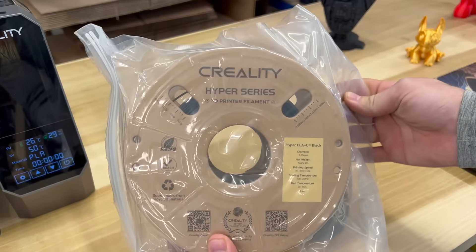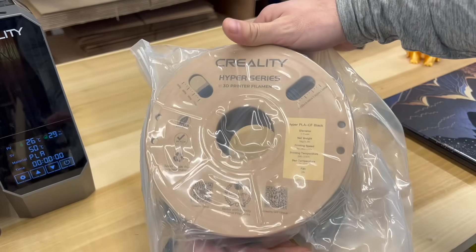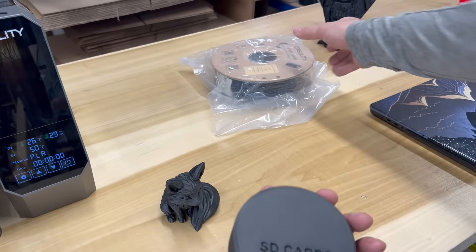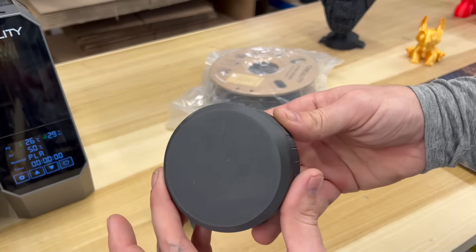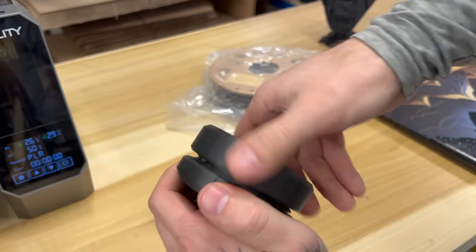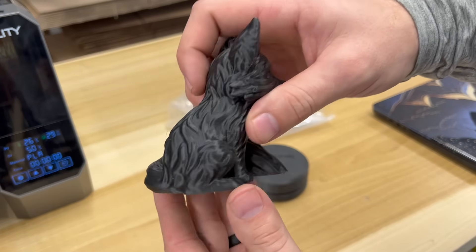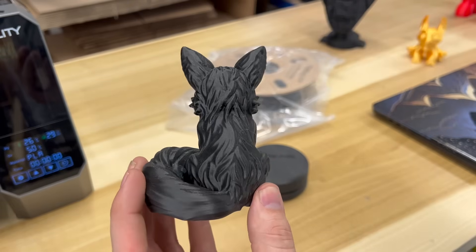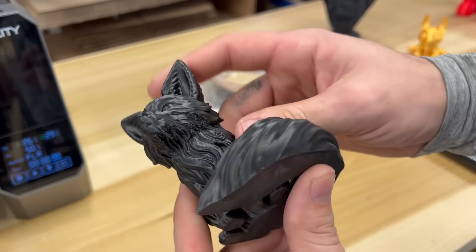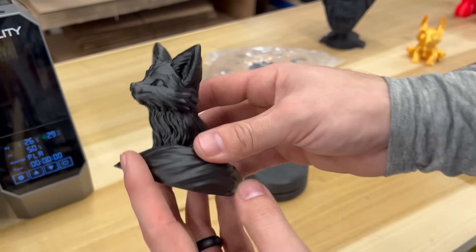So this is the carbon fiber PLA they sent me with the printer - I used most of the roll. It's a little more expensive, $25 to $30 seems to be the price. It's definitely worth a try if your printer has the ability. I've printed a lot of things with it - I either sold them or gave them away. But this is like the first thing I printed. The first layer isn't the best, but this side of it looks beautiful - it just prints beautifully. Great looking prints. The quality and how well it prints is just wonderful. It's a fibrous filament so it's going to look a little better naturally. The only issue on this print is I should have maybe slowed it down on the overhangs - I ran no supports. But overall I'm not disappointed in any way with this print.